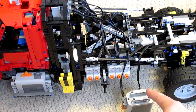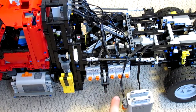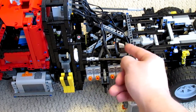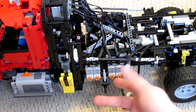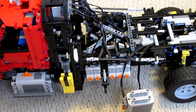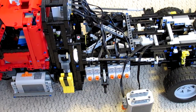As the outriggers are deployed, these switches will actually switch. On the opposite side the switches are open, and on this side they're closed. When the outriggers are fully down, these will be closed and on the opposite side they will be open. So during the outrigger extension process, the vehicle will switch between driving and digging. That's actually quite neat.